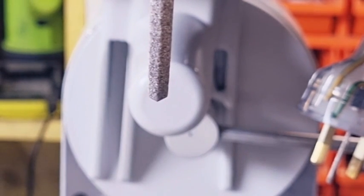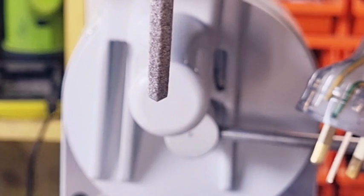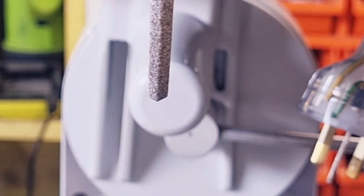So that's what the hexa wheel looks like. I did do another video where you can get a hexa profile by using 15 degrees offset on the vertical axis and 15 degrees on the horizontal axis — that'll give you a spacing of 120 degrees. That's a different method. Thanks for watching. Give us a thumbs up. Bye for now.